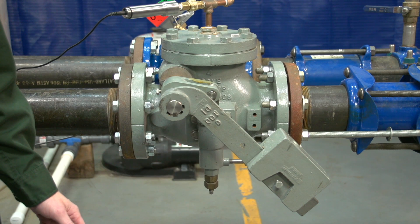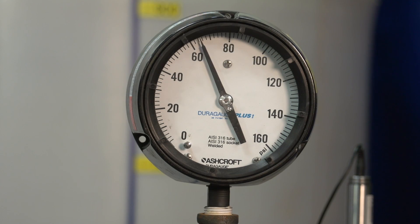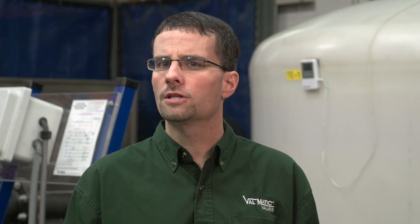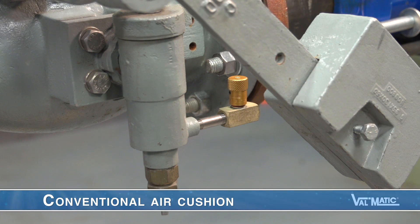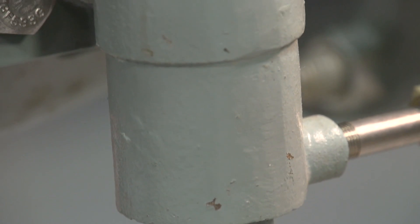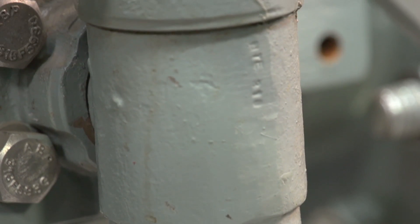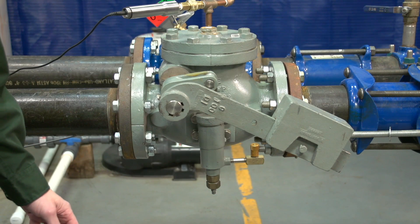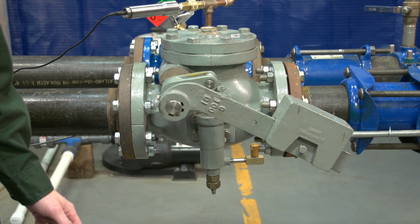The reason we heard a slam is because the water flow reversed and went backwards through the valve before it closed. Then, when the valve closed suddenly, it stopped the reverse flow almost instantly, causing the water hammer. The solution to preventing slamming in this type of check valve is to get it closed faster before the reverse flow can develop. Unfortunately, a conventional air cushion tends to slow down rather than speed up the closure of the valve. This allows the reverse flow to increase, and then when the reverse flow pushes violently on the disc, the air in the cylinder is compressed and cannot prevent the disc from rapidly closing, causing the slam.